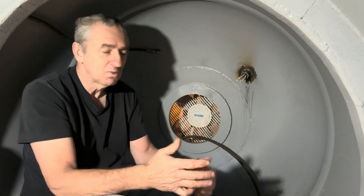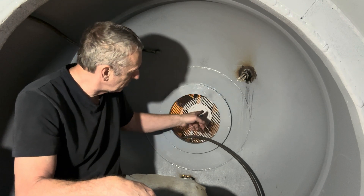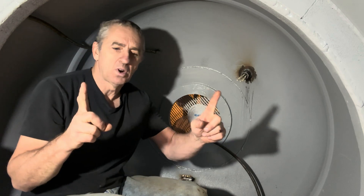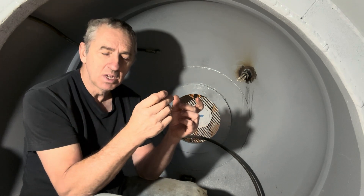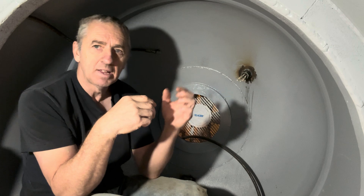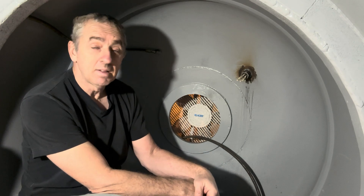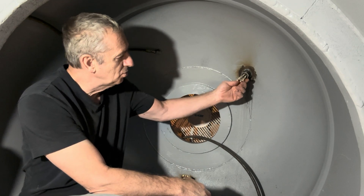Two of these wires are for the external light, which is mounted right above the window on the underside of the ballast tank. It's an oil-filled 10,000-lumen LED light bar. I take the LED panel out, slide it into a clear vinyl tube with plastic end caps and an electrical penetrator, then fill it with vegetable oil — I use vegetable oil so if anything fails I'm not polluting the lakes. They work fantastic; I've tested them to 3,000 feet, no problem.